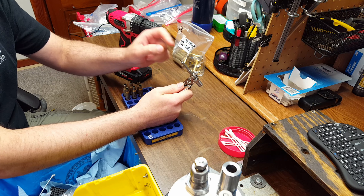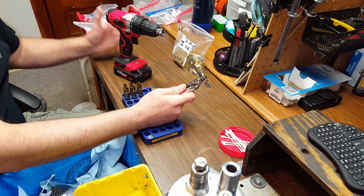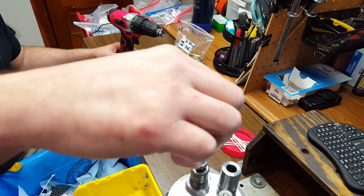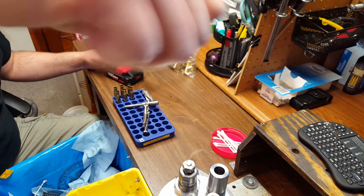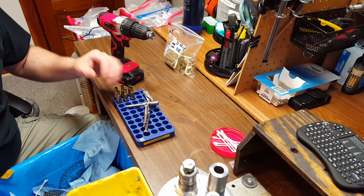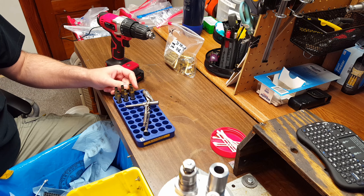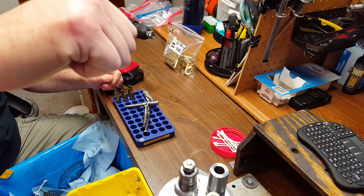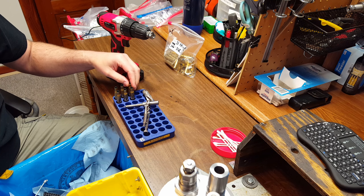The biggest problem with this is when I trim my Berdan-primed GP11 brass for 7.5 Swiss — the Lee system doesn't work with a Berdan case, so that's why I keep the lathe-style trimmers around for those. I have tried the Lee die system where you bring your brass up through and use a crank or drill on top. It's nice because it trims, chamfers, and deburrs all in one step, but I had a horrible time with the trim length varying between cases depending on how much pressure I put on the crank — giving me lengths from way under to not trimming enough.